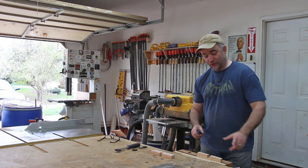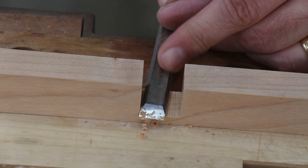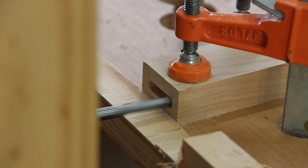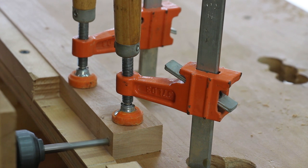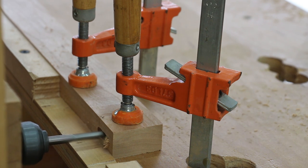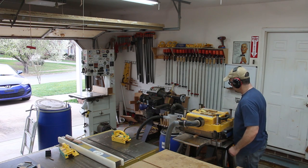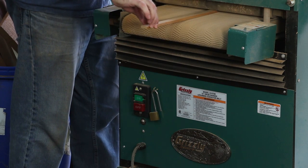The next step — because you're never going to see the bottom of these dados, but I'm going to clean them up with a chisel. I'm going to work on the joinery next, and for that I'm going to use floating tenons. To make all the end-grain mortises in all the pieces, I'm going to use my horizontal mortise center. This will become the loose tenon stock — all I need to do now is plane it to thickness and round over all of the edges. I took my loose tenon stock almost to the thickness that I need at the planer, and I'll take it to its final thickness using my drum sander.